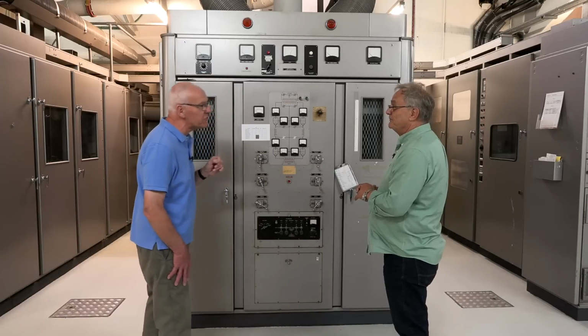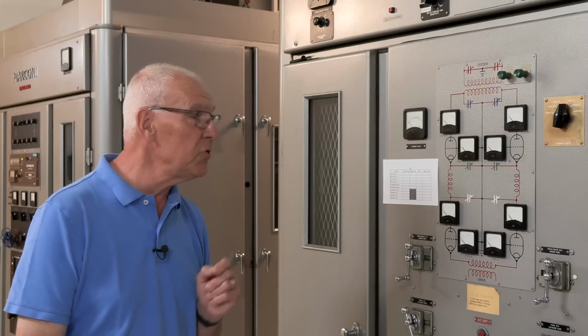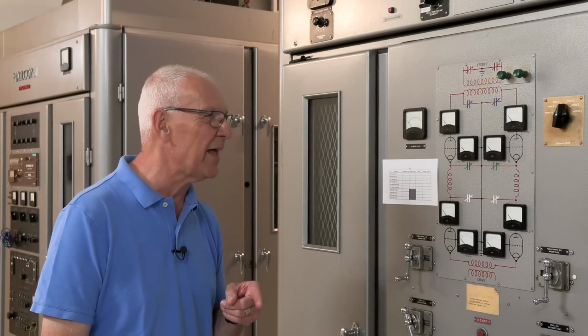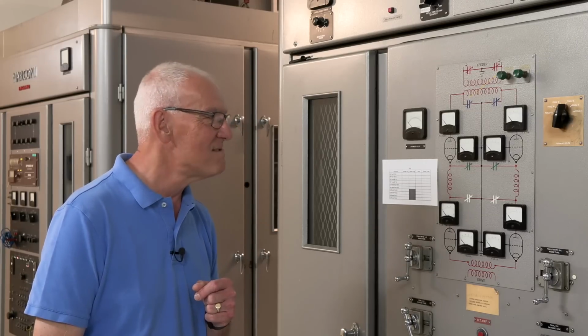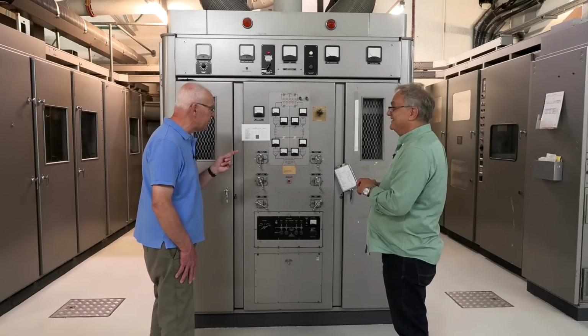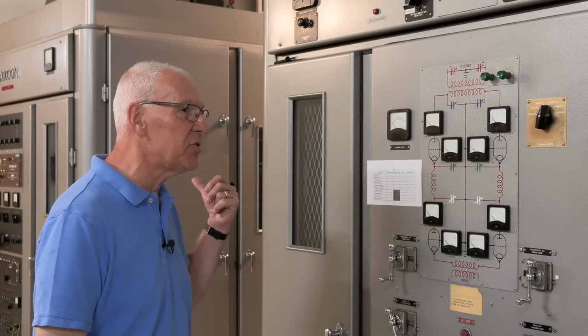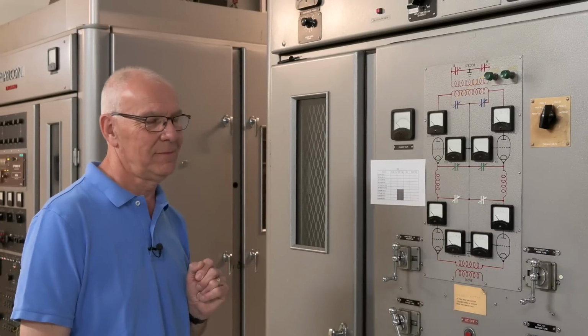To get 250 kilowatts out of the machine, you'll need to put about 360 kilowatts of DC in. So that's the first figure to remember. To get to 100% modulation, you'll need 180,000 watts of audio. I'll just say that again, Bob. 180,000 watts of audio. Right, so a pair of KT88s is not going to do it? No, it's much easier if you have the same valves in the modulator as you have in the final. What we do, very cleverly, is to use the same tubes in the RF section as we use in the modulator, which is just a big boy's audio amplifier to 180,000 watts.